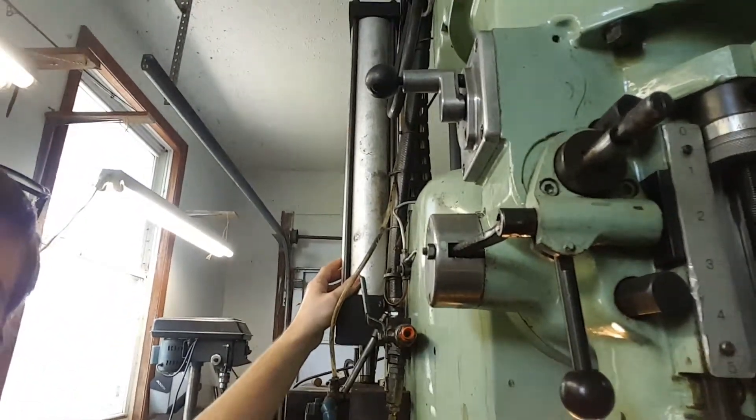Jitter was another reason why stepper motors would have been better for this, because if the jitter is excessive it can show up on your parts. As a downside to how this machine is constructed, the air compressor always has to run with it because it's not a counterweighted system. There's a big cylinder back there that gives us pressure and offsets the head so the ball screws don't eat themselves up over time.